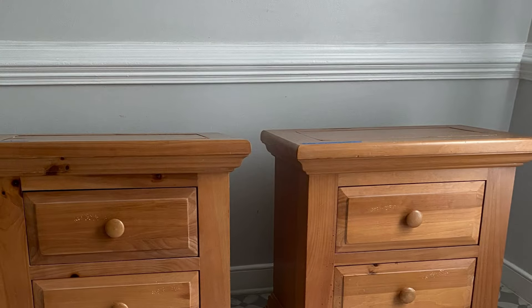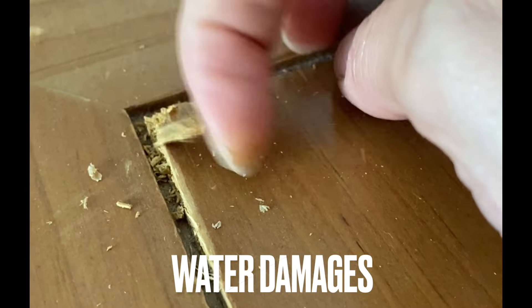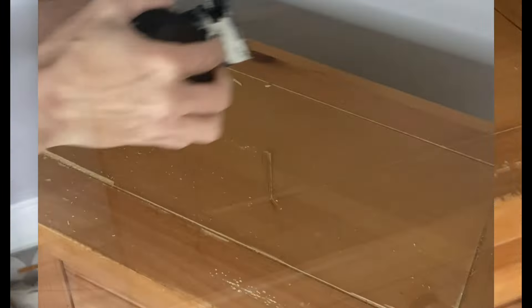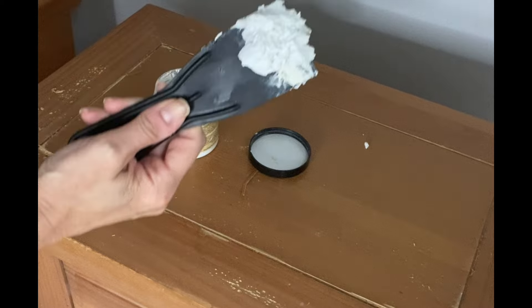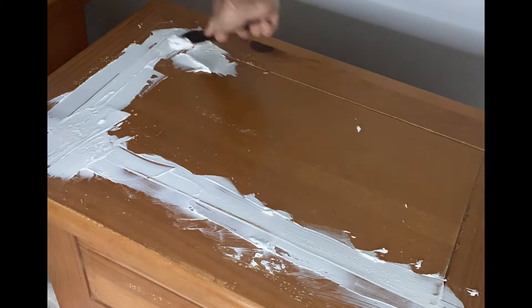After a quick inspection I decided on my color palette — I'm going to stain the tops and paint the base. But when I looked a little closer I found water damage on top of the piece. Water damage over particle board means it is going to keep expanding, so first I removed any of the broken and loose bits, leaving a big hole.